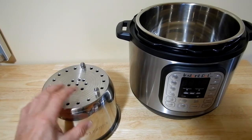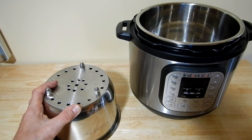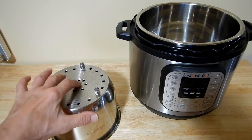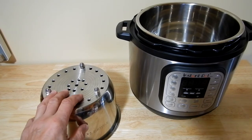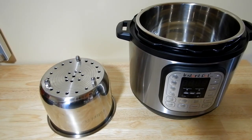I've got to say I'm really happy with this conversion. This stainless steel pot is so much better to use than the metal basket that came with the air fryer lid attachment for this Instant Pot. The three quart pot was $24.95 off Amazon. The hardest part is you've got to have a drill press and a quarter-inch diameter carbide ball end mill — and it will easily drill these out. If this is something you're thinking about doing, I've just shown it can be done and I'm happy with it.